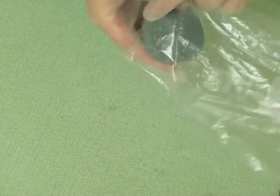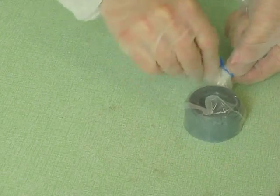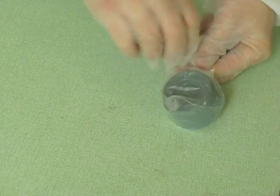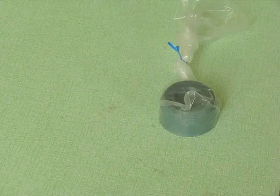Once it is set, we place the sample in a plastic bag, hermetically closed, or dip it in water and store it for at least 5 days at room temperature. But for a fully cured material and getting the best results, keep it covered for 28 days.